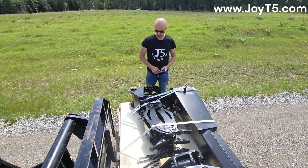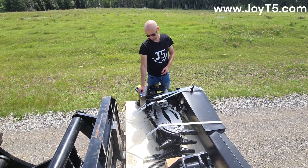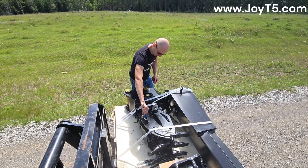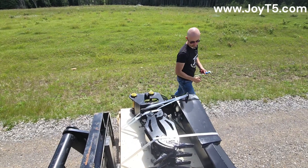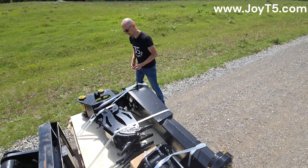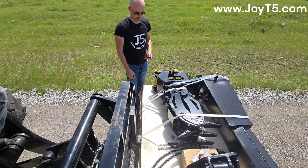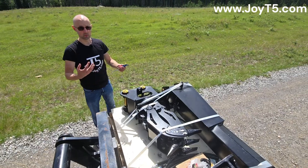In this specific grapple our base plates are 16 millimeters thick and they're the same on the top and the bottom. The thickness of the tine on the sides here is 12 millimeters. This grapple has replaceable teeth on each side and it has double cylinders. We also got cylinder shields to help protect the cylinders from being damaged, and then as you see here there's a device that will stop the grapple from opening in case your hoses fail.